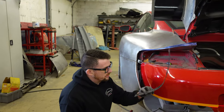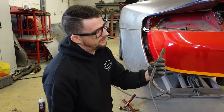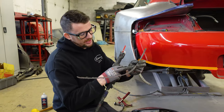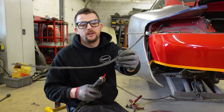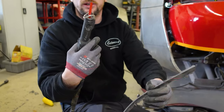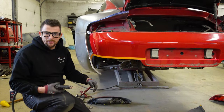The secret to cutting plastic and urethane like this is to keep your saw at a lower speed — it keeps the blade cool and keeps it from melting. On this side I cut with a dull blade that got hot, and you can see how it melted the edge and came out ugly. This is the side I just did — it's a lot crisper. If you keep it nice and cool and don't force it, it comes out a lot better.